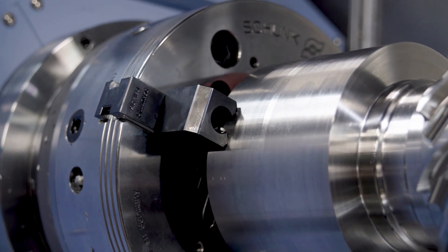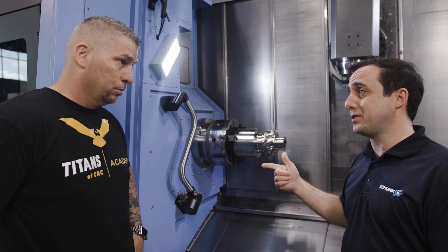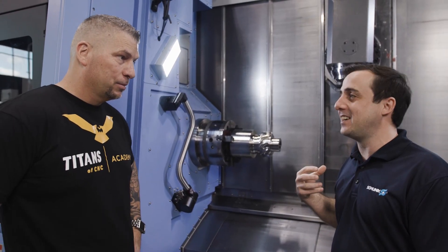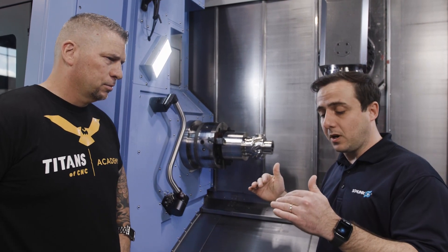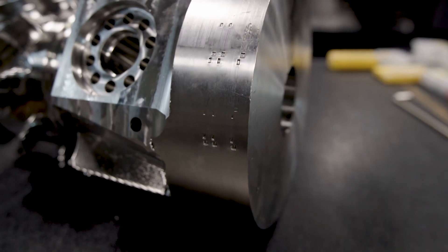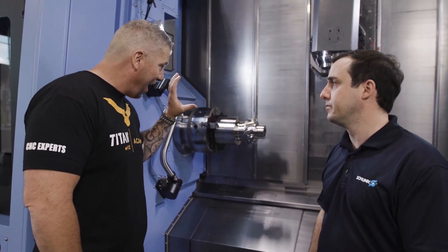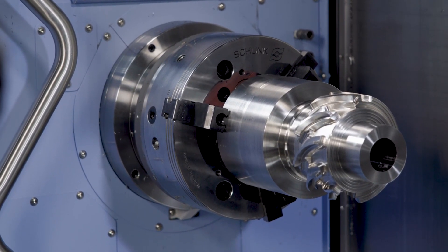With claw jaws, you're only as strong as your weakest link, and those claw jaws were not the weakest link. A lot of times when you're clamping with jaws on a part like this, you rely on friction. But when you first came to me with this part — 140 pounds hanging way out — even I was a little nervous. You've got to have the claw jaws biting into that material. Instead of just relying on friction, you're making a mechanical grip into the material. You can actually see where it's biting in — it's not just friction anymore, it's a mechanical hold. We would never be able to attempt these cuts on that heavy a piece in a chuck with just soft jaws or hard jaws without those teeth.